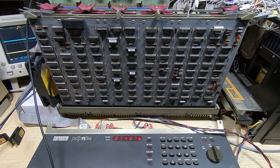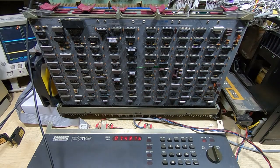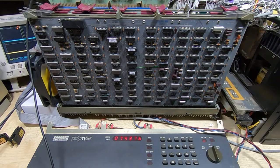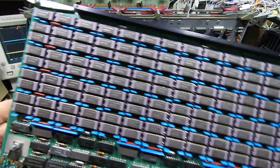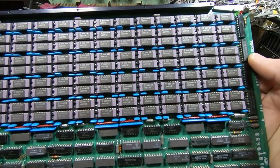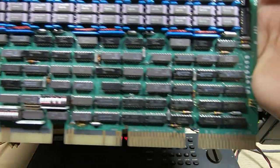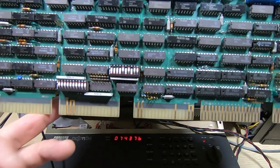We've made some good progress. The system I believe is now capable of booting from floppy disk — I just need more RAM. It was just a couple of failed ICs and some open circuit tracks on the RX02 control board. I think the reason it won't boot now is just lack of RAM, so the next thing I need to look at is getting the 128K RAM card working. It does pass all RAM tests but just won't boot up — there's also an awful lot of glue logic on it for a RAM card.